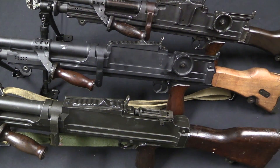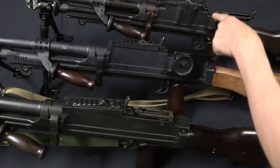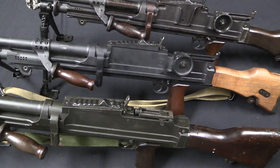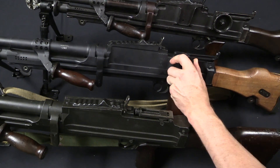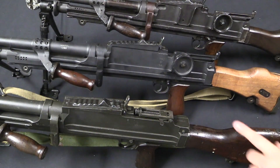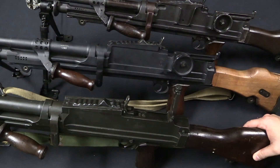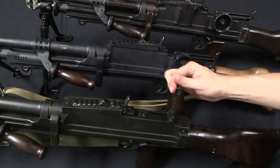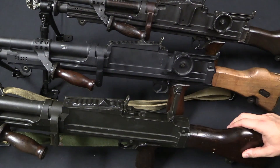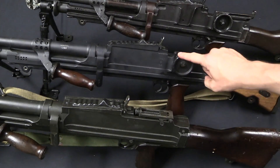If we go to a whole new design of receiver, a lot of this can be made simpler. You can see the complex steps here in the back of the receiver — if you just make the whole thing a little bit taller, you can have more straight lines, and that's faster and easier to machine. The drum sight on the original was pretty complex with a lot of spring-loaded bits and cams inside. Instead they adopted a much more typical micrometer ladder rear sight. You no longer need the first dovetail on the receiver either, so you can make the whole thing flat-sided. This ladder sight in place of the early dial sight is the most easily distinguishable visual feature of the Mark 2 Bren.